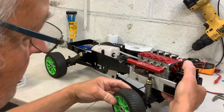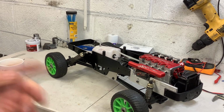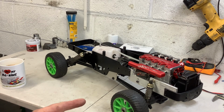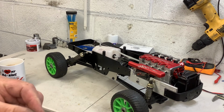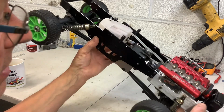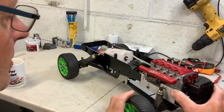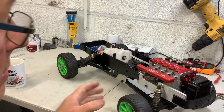I've got a 2-shoe clutch in there. It's a Campagnuolo PTF. Normally they use a 3-shoe in a Campagnuolo car, but I've actually built this clutch up using 2 shoes, and it's got the hairpin springs that go onto the centre shaft, the pilot shaft, which I made myself. So I'm not sure whether it's going to work. We'll have to see.